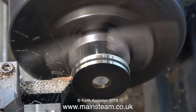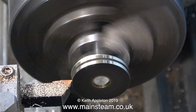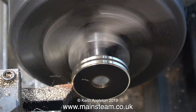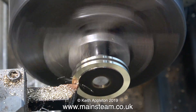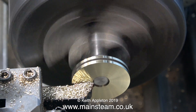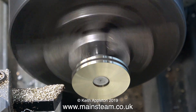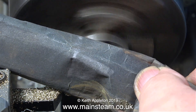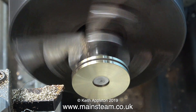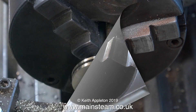The first part of the job is to true up the external diameter, and I'm having to take quite a lot of metal off because it's so far out of round. I keep stopping the lathe just to check progress and see how much more I need to take off. I think this is the final cut and it should be okay. Notice how I very quickly used the back of the lathe tool to remove the sharp edges from the other side of the pulley — the last thing you want on a rotating pulley is a sharp edge. To complete the edge removal I'm using some wet-or-dry sandpaper; I just want to remove the sharpness, because a 90-degree cut is razor sharp.